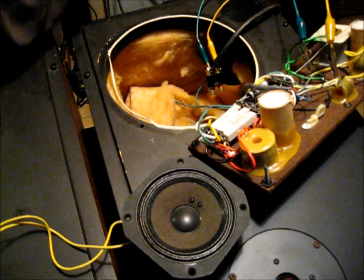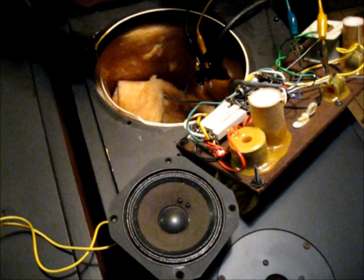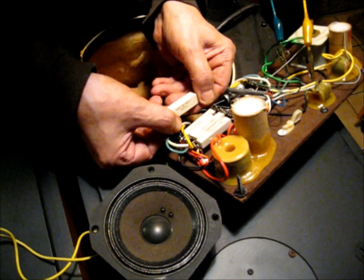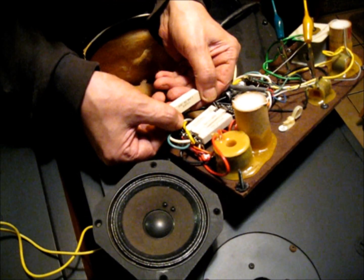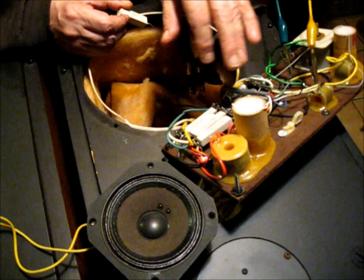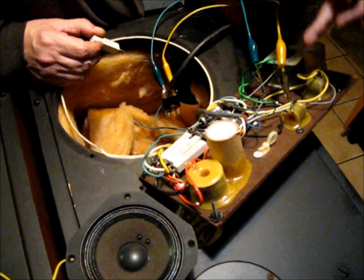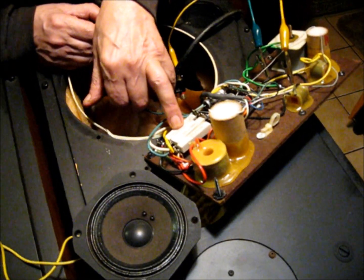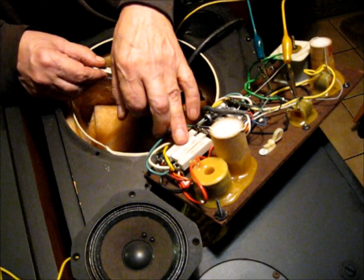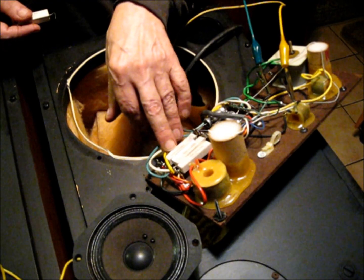I'll verify this resistor is bad with my meter. This resistor is 2.5 ohm. Here's a 1 ohm resistor — and there it is. The inductors are almost always good; occasional failure, but usually that's when they come loose from the board. But this 2.5 ohm resistor — that's rare, but it does happen. So in this case: recap, and then change out that resistor.